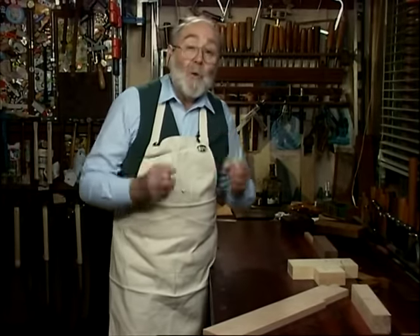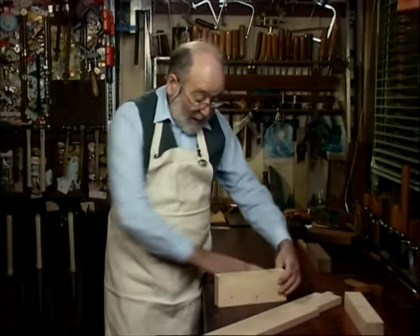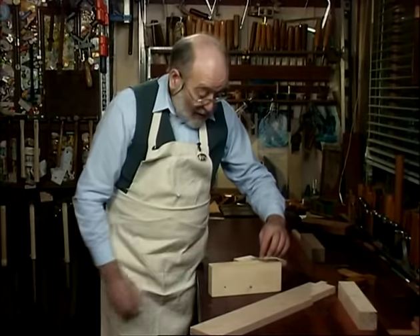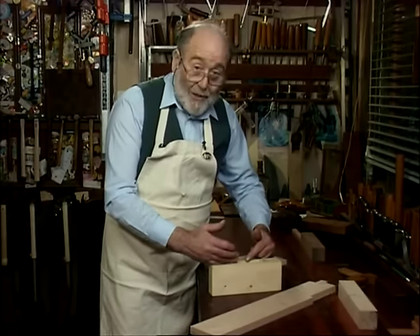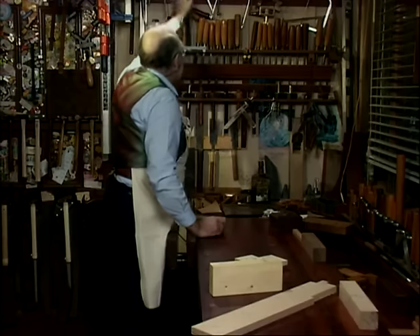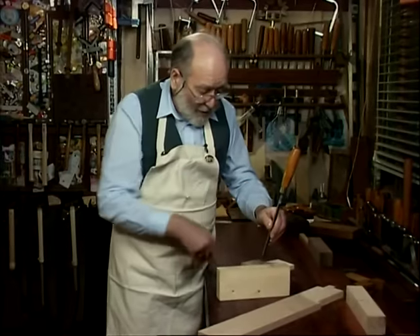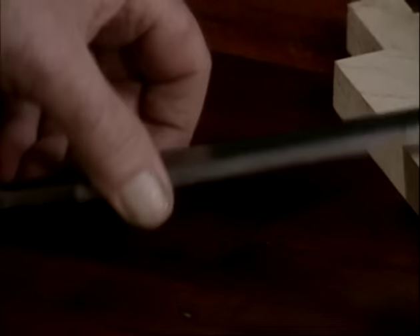Before we can set out, we need to decide on the width of the mortise. On a straightforward square job like this, it's usually a third the width of the wood. Of course chisels don't come that accurate, so we give the chisel the benefit of the doubt — if you've got a chisel a bit wider or a bit narrower than a third, you go for the wider one. You'll see that the chisel is a nice tight fit in the mortise — nothing has been pared off the sides. This is an ordinary firmer chisel, a general purpose tool, and certainly you can chop mortises with it.